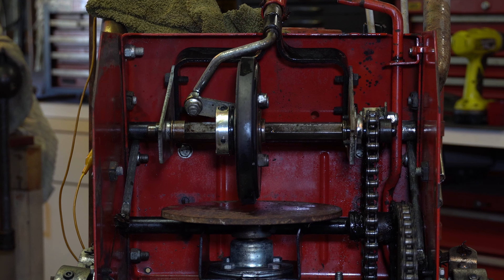So I'll just show you a close-up. This is first, that's second, and we're out of room. We'll pull it over to neutral. I was actually getting stuck—I wasn't even going into neutral at one point, so we're almost there. If I put another little bend here, I think the bend has got to be relaxed a bit to pull this whole wheel over. See how it wants to go? It needs to be about here, and then I think we'll be okay.